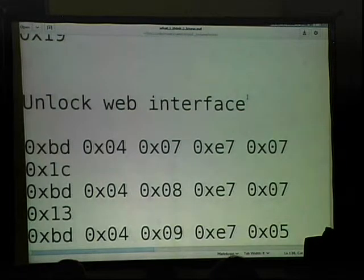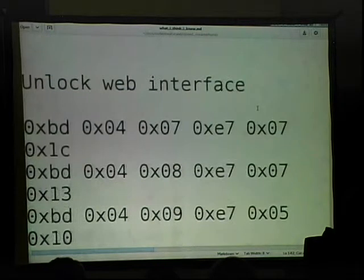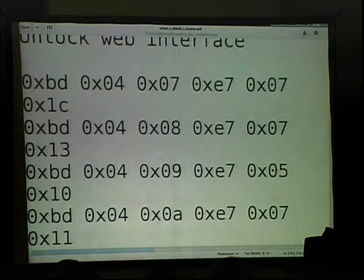So like the majority of the message I thought I understood very easily. Like, for example, this is what happens when you unlock. So when you unlock, it's the standard header that I was talking about before, 4 bytes, sequence number 7, and the addresses. The command that's being sent is a 7, which is a status check, and then the checksum. And then it sent it again because the microcontroller was slow because it was sleeping. And it was like, give me the damn status. And it finally replied back. And then I said, okay, so the status was that the door was still locked.